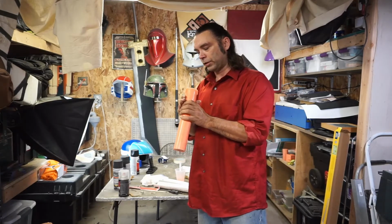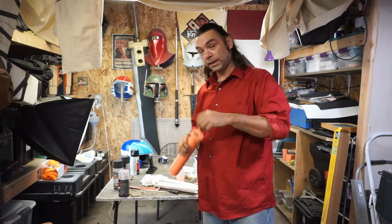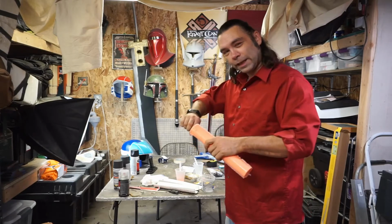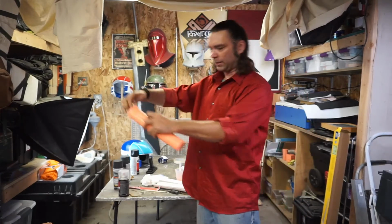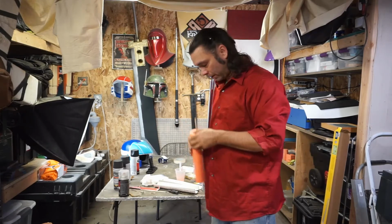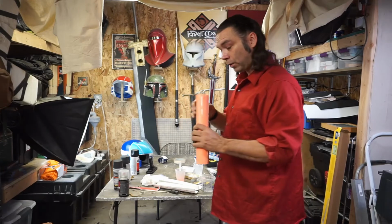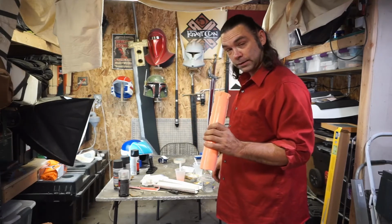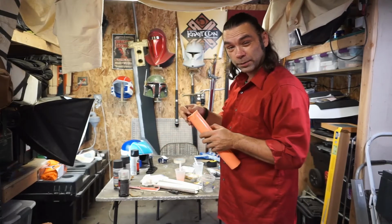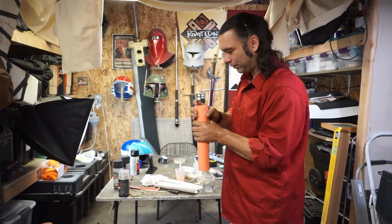They make this silicone called Sorta Clear, another Smooth-On product, and it is, as the name implies, sorta clear, which makes finding the edges way easier. With that, I'd be like, it looks like it's right about here. Again, had I marked it in the beginning when I thought about it, none of this would be a problem. Or I just said heck with it and cut it where I think it might be, and if I've got a parting line, it's just a little bit of sanding. I'm hoping to not have any parting lines visible.